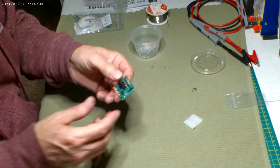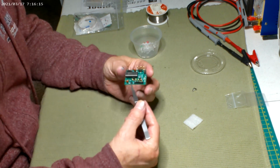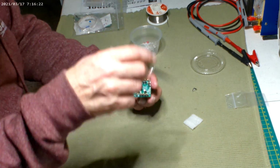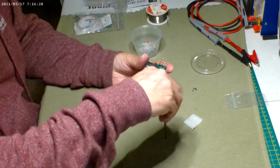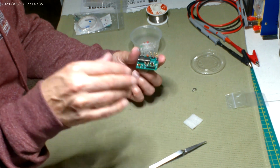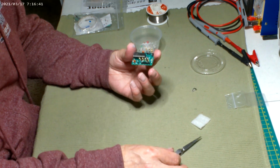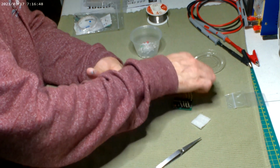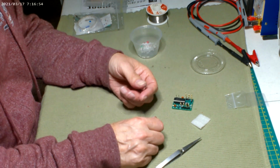Especially when you have good instructions, and like I said, boards like these you can find online and get them really cheap, even yourself, if you want a flashboard. This is an actual effects board that does things, but even the flashboards I get from Gary are simple to put together. You have the one that's variable, gives you a spinning thing. You can change the flashing rate, or you find simple ones where, depending on what components you use, you can swap out a resistor or a capacitor here and there and change the timing. Or you can order boards with certain specific timing that are simple flash, not variable. And that's it, very simple.